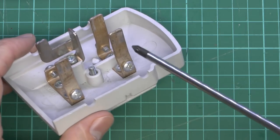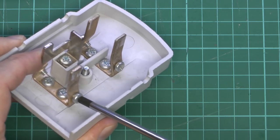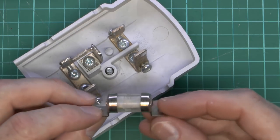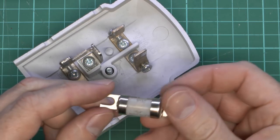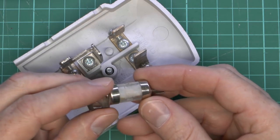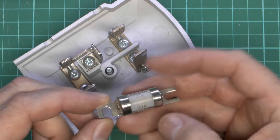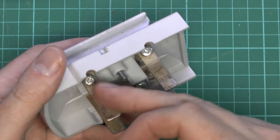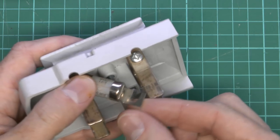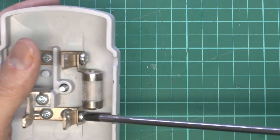When you buy these, they don't come with fuses — you have to get those separately. The fuses go on these screw terminals, and there's a nice recess for the screwdriver. The fuses are this style, which are LST fuses — there may be other names from other manufacturers. Various ratings are available; this one is a 20 amp, as you can see on top of the fuse. It has two holes at right angles to each other. To install the fuse, just loosen the two screws, slot one end over behind that, then the other side slots down over the top, and tighten the screws to fix it in position.